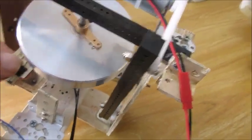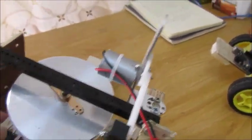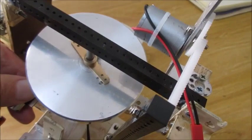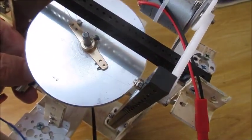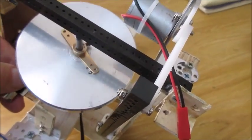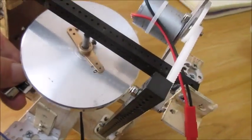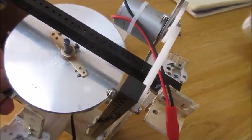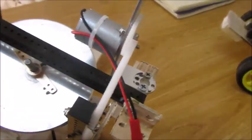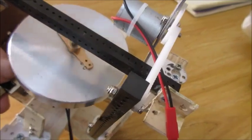That's basically how this thing works. The Arduino just controls the signal that goes to the motor — pull up or pull down. The trick I learned is that if you're applying a force, you can't apply a constant force. You have to apply a 50-millisecond force, and then shut the motor off so that the gyroscope is free to precess back to its normal position. So if it's falling down, I apply a 50-millisecond force downward with the motor, then shut it off, and it's allowed to freely precess back.